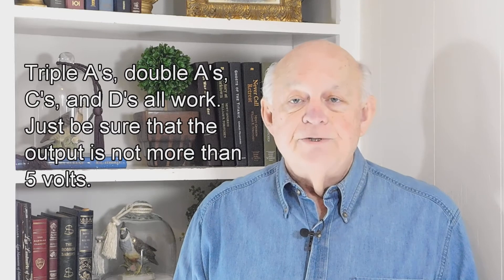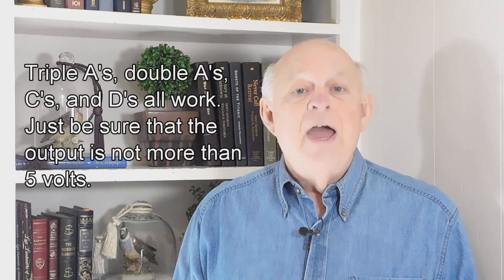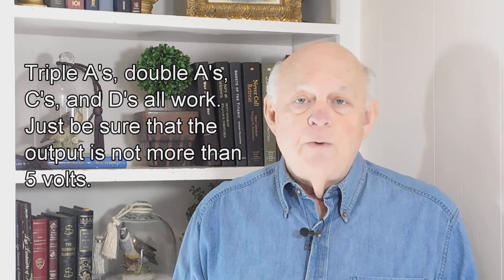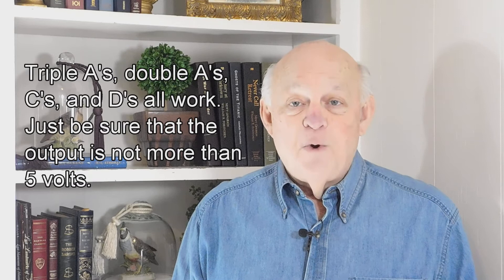The power for the circuit comes from three AAA batteries in series for a total of 4.5 volts, but you can use any DC power supply you have as long as it's well regulated and never goes below 3 volts or above 5 volts — the PICAXE microcontroller will likely die if you feed it more than 5 volts. So the circuit can be used as either a code practice oscillator or as a keyer for a radio transmitter, and it's just that simple.